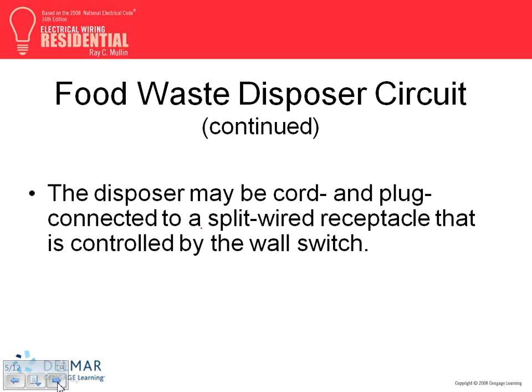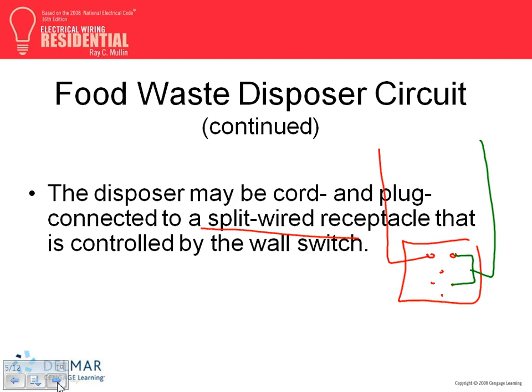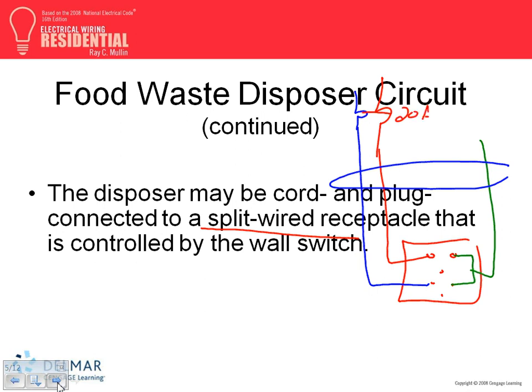So what they did, guys, split receptacles. Let's just talk a little bit about split receptacles. If you forgot about split receptacles, you connect the neutral on one side, right? And what do you do with the phase? The hot one and hot two. Here's your split receptacle, and that will get you your multi-wire circuit. And here's your 20 amp here, and here's your other 20 amp here. You tie them together by code, put 20 amp, and you share one neutral. That's the most common.